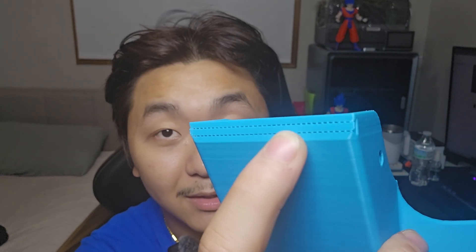You can print this bin without any support, which is amazing. And for the slide, you can print the slide without any support except support needs to be here and here just for this, because there's no other way to 3D model this to make it print without any support. The model prints laying flat. There is a huge support right here that you need to have, but I made a custom support so that you don't have to use the support tree on the slicer and waste all the materials. The support tree is going to build from here, go all the way up, and that is just a huge waste of material.